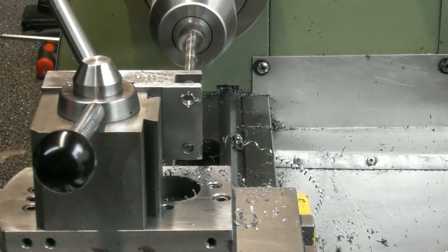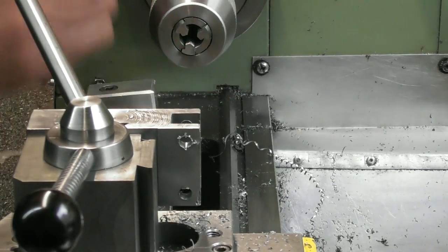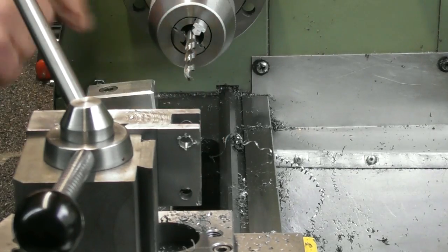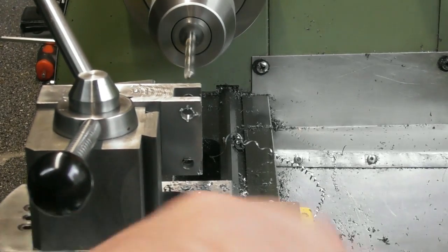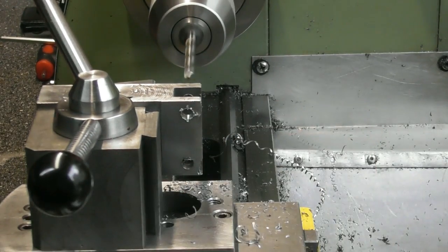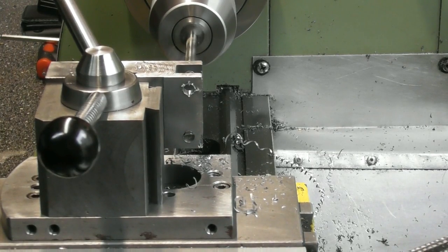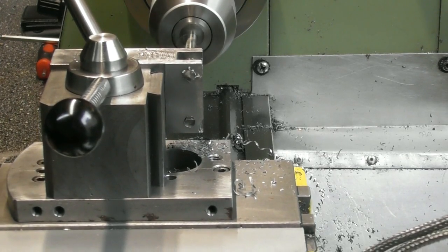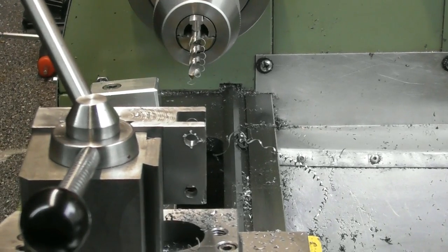Yeah, so we managed to drill the top one in exactly the same way as the bottom one. You know, no matter how often I do it, when I got the chuck in the headstock with this quick release chuck, I always go to turn it the wrong way to start with. It's force of habit with it being on the tailstock end. When it's on the headstock end, it just feels weird. Anyway, that's a 5.9, and you get the picture. I'll put the 6mm reamer in next.